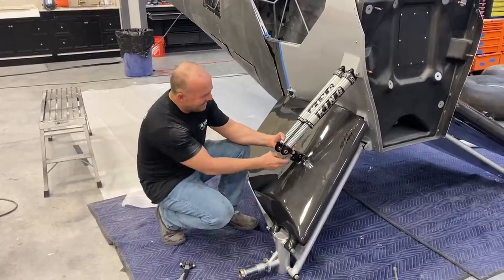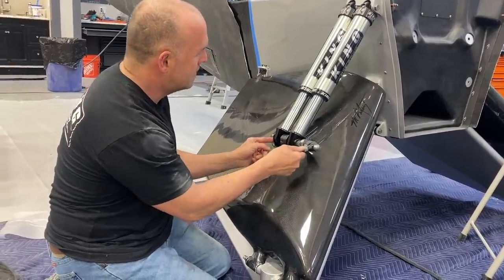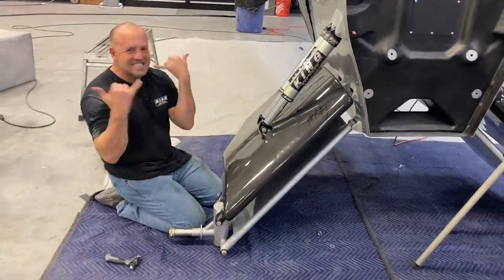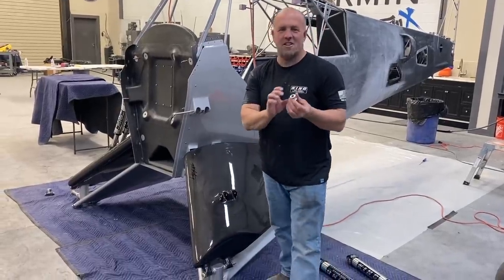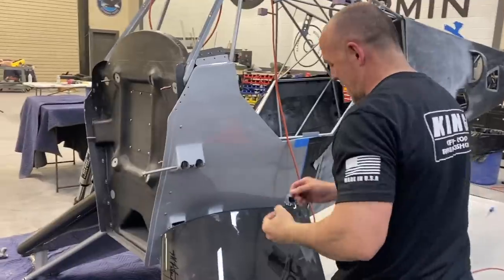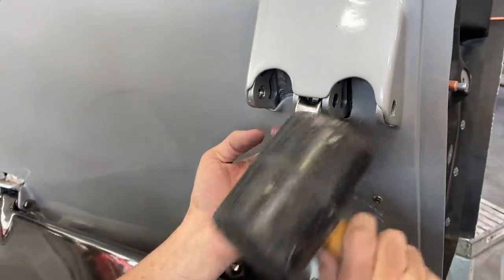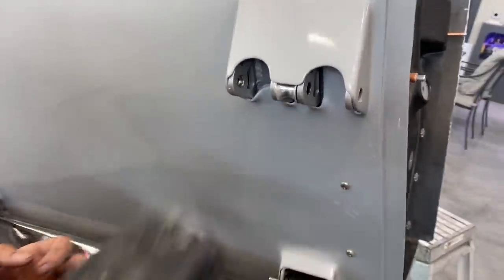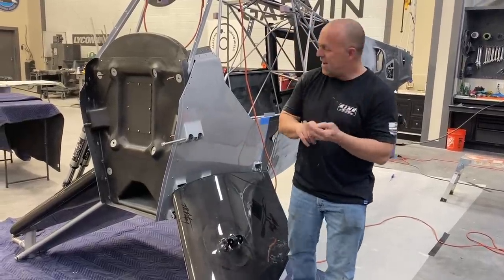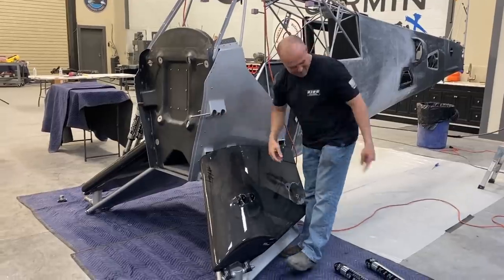I am so happy right now. I'll have to lift the plane up to get these into their little perches. One side done — man, that feels good. I've got another set of shocks to put on. I want to show you this little part I made — just simple details, but this super lightweight aluminum little part I designed to go right in between here. I'll just gently tap that in. What that allows me to do is put one bolt and cinch them all together without trying to bend these metal welded-on tabs or brackets. Without it, I'd have had to use a big steel bracket with a big opening. Little details, saves weight. Slide that in, put these shocks in, we'll be done.